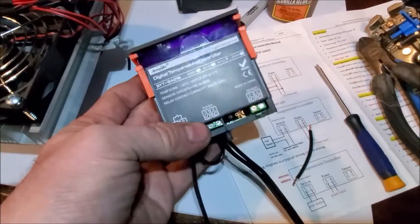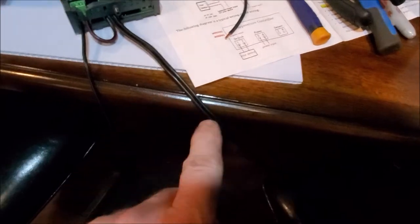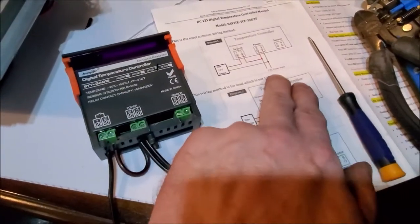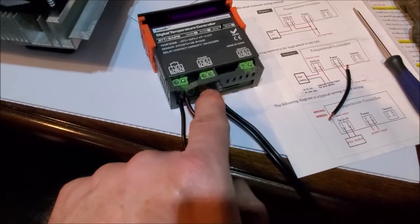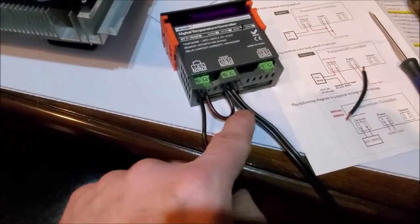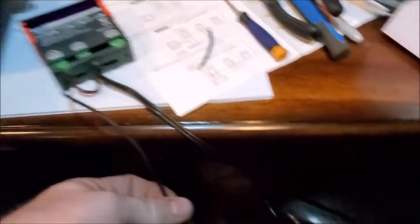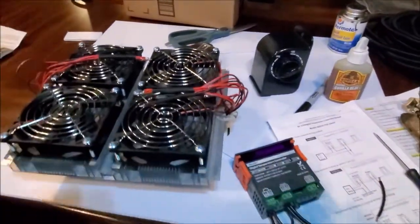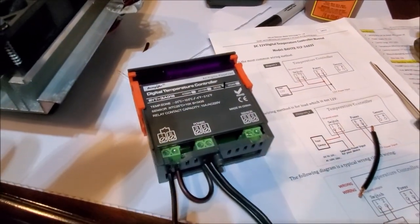When wiring up the controller, I'm basically setting it up on diagram one. We've got the two leads — 12 volts going in — and then I'm going to have a jumper that comes over between pins 3 and 2, which is a single red wire. Then I'm going to have a single red wire which is going to be the main supply going out to the unit behind there. If you're following along, that is how we are going to wire that up.